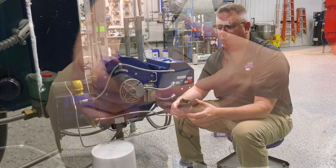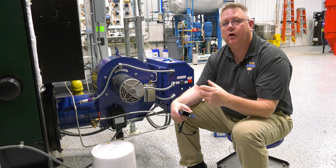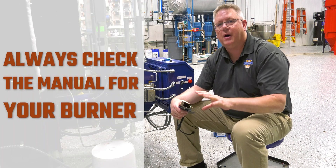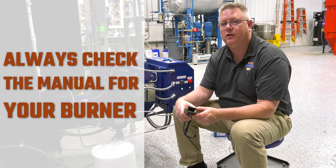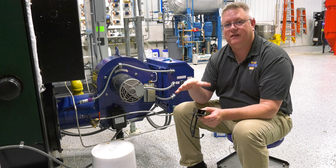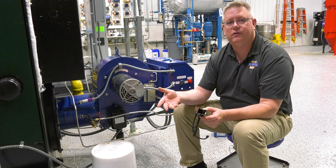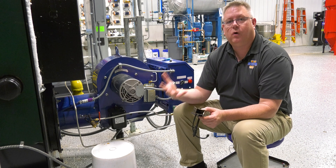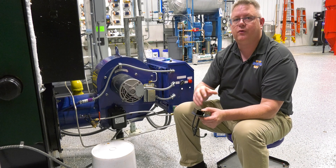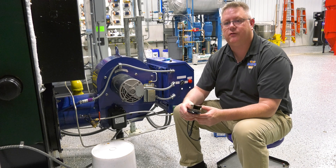The depth is also important because they obviously designed these with some intent. Refer to the manual on your burner to make sure you've got that pilot assembly in the right location. If you've got a reliable pilot, it's not bad to take that opportunity to pull the pilot assembly, take some internal photos, and make sure when it's working you know what that looks like — so that if somebody moves or loosens a part, we can reorient it back to that factory spot.